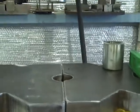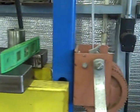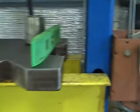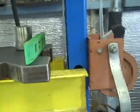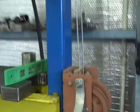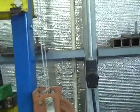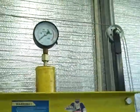When you've got transmissions or other heavy stuff on top of it, one of the things you really need is a movable bed that can carry the load. A fabricator shop a couple of miles from here — the old timer there has this set up on his. I looked at it, talked to him about it, and he told me how he did it. Most of the stuff is just garage door wire rope and pulleys, and it'll easily handle four to five hundred pounds without any issues.